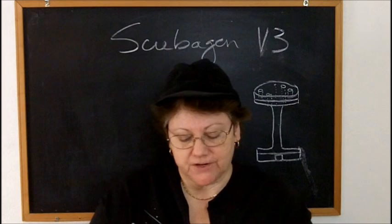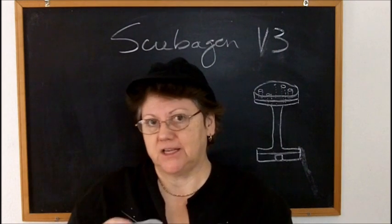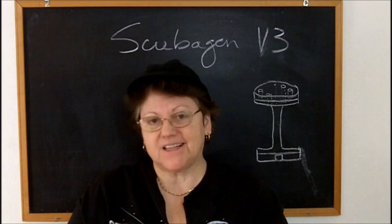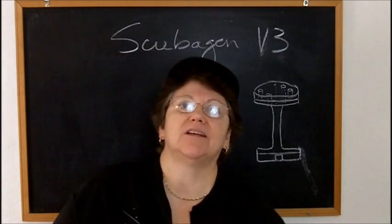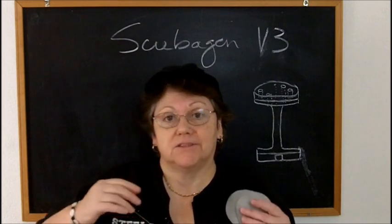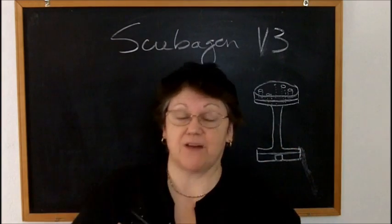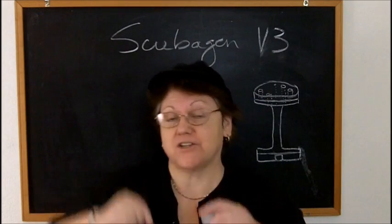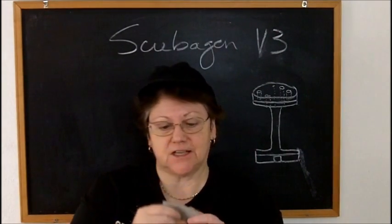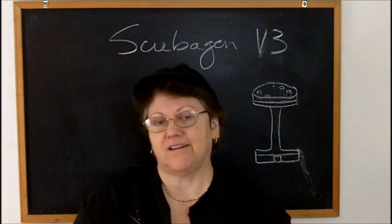Last year when I was doing my experiments with this stainless steel mesh, I tried all different ways and all different temperatures of heating it and quenching it to see for myself, because a lot of people were talking about this. And it conducts. What they're counting on is like if you have a battery operated radio and you turn it on and it doesn't play, and you know the batteries are good, you pull out the batteries and sand off the little connections and put the battery back in and see if it works, because it's gotten a little bit of tarnish on the battery connectors and isn't making good contact. That's what they're trying to accomplish with heating and quenching the stainless steel: to get a little bit of tarnish on the surface, and that's what you're counting on to make it non-conductive.